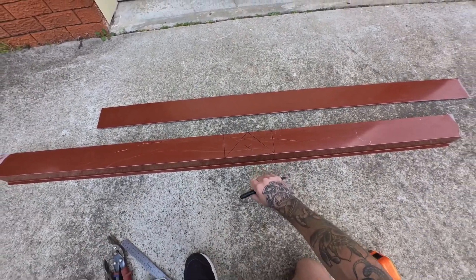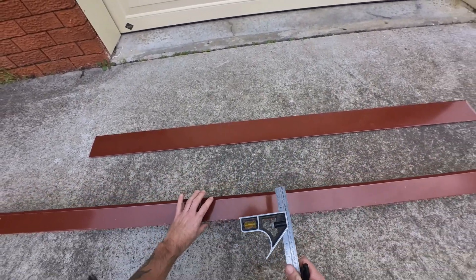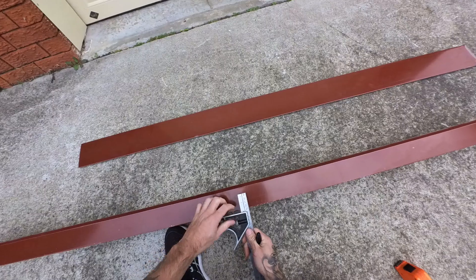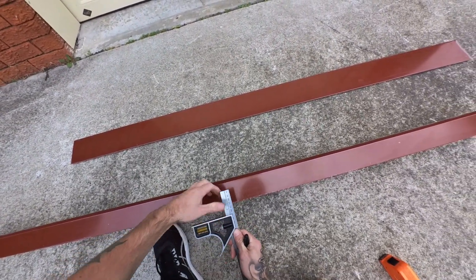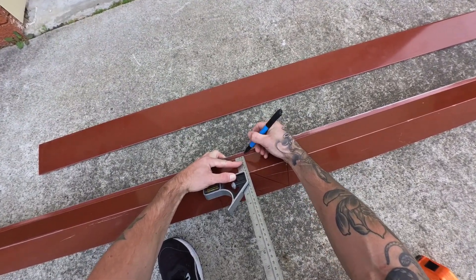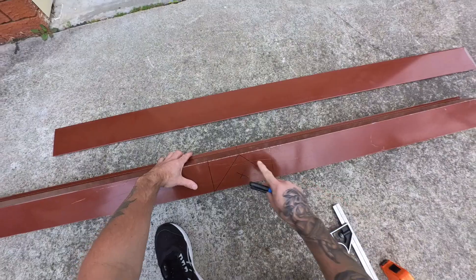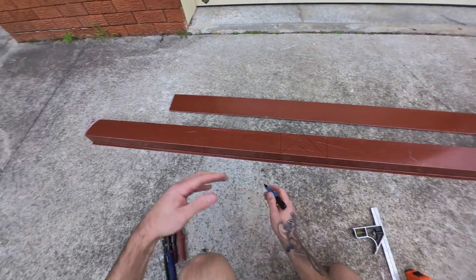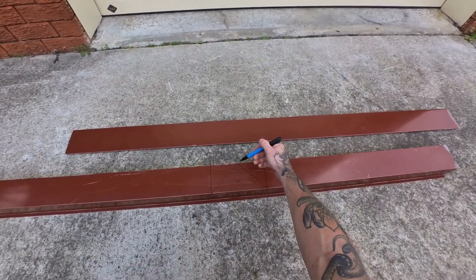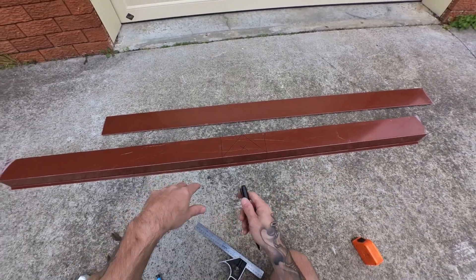Where the crosses are is what we're cutting out. For that to bend, you just get a mark in the center and snip just that section out — not all the way up, just that section in the center. Basically we've measured a meter and then gone 45 and 45 to find out the section we're cutting out, so it bends down.